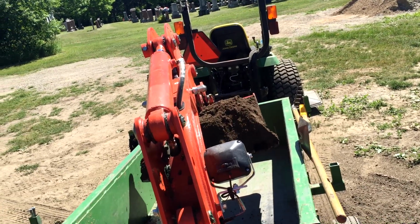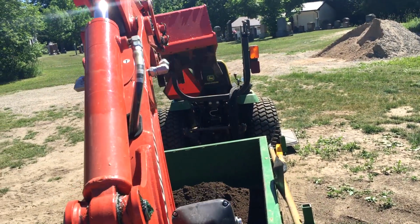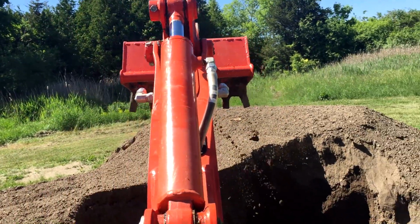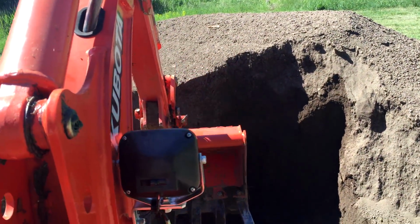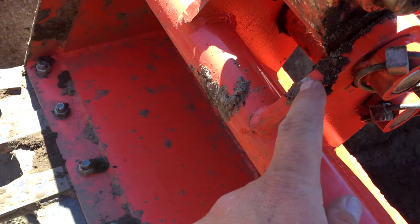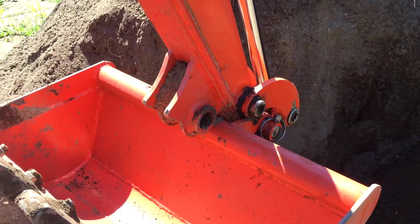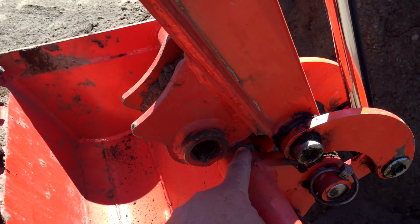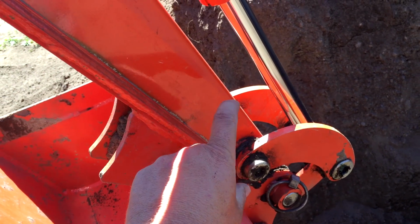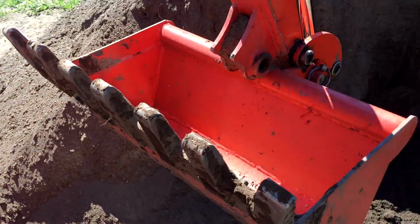But I think I noticed the problem before, and it's where the ears on the bucket mount to the pinholes. I need to hollow the one spot out a little bit. I think I showed you this. You can see where it comes up here and hits on there, I think it is. Oh, I don't have much more because this is going to hit on here, so maybe I won't bother changing it. What I need to do is reposition the ears. They need to be further up higher and out more. That would reduce my open power a lot.